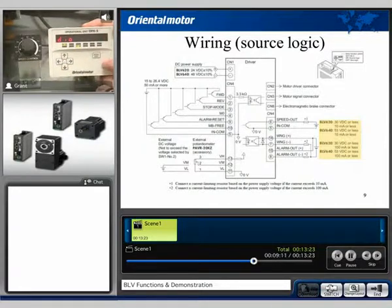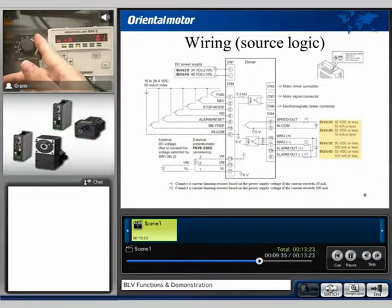We also have the ability to physically monitor the I/O. Right now it's showing me that two inputs are on on the input side. It's showing me that there's only one output, which is the move output currently being activated. It also shows me that right now for the voltage input, if we were using an external potentiometer or a 0 to 5 or 0 to 10 volt input signal, it'll monitor that voltage input for reference. As we can see, as I'm increasing the speed, the voltage in is increasing.